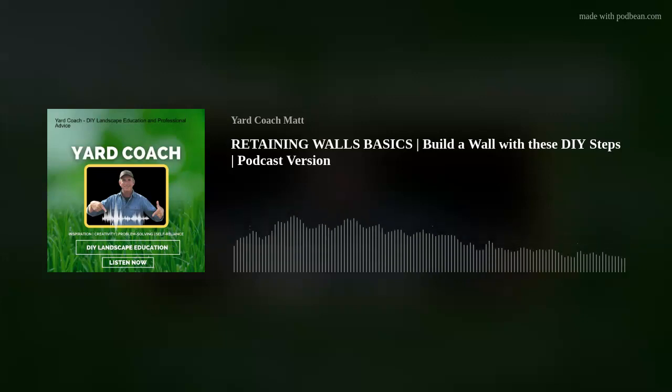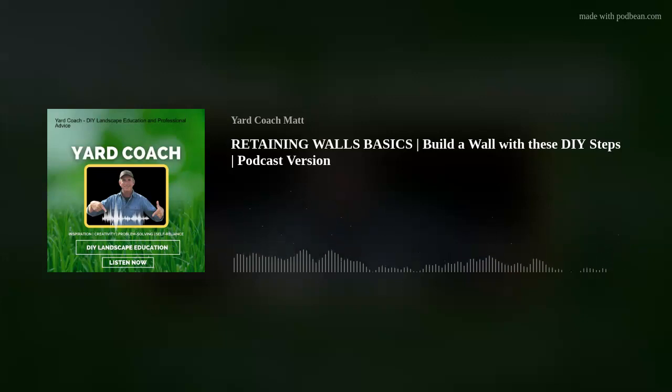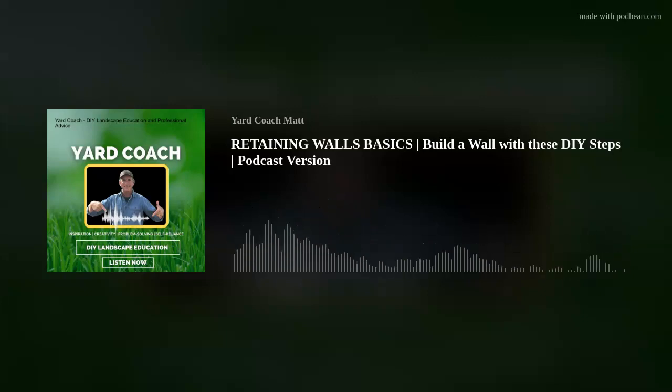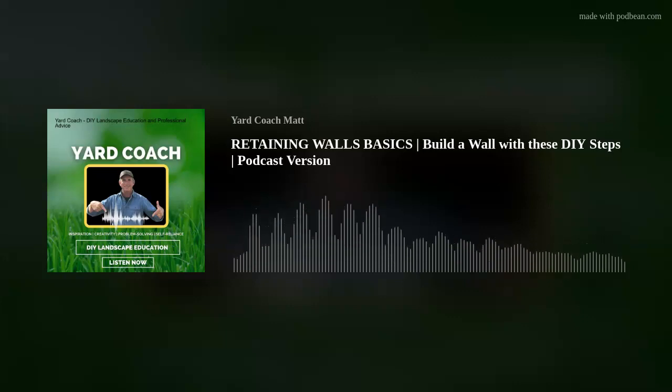So you've knitted your first course together, and then the second and third course, whatever height you're going to go, you're going to set that second course back into the hill, leaving a set amount exposed of the first base layer. You're not going straight vertical, you're going slightly back for your second course. This will stabilize the wall, this will stabilize the hillside, and the wall will be so much stronger for it.